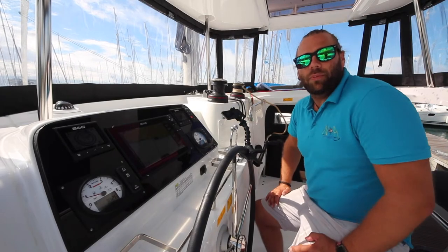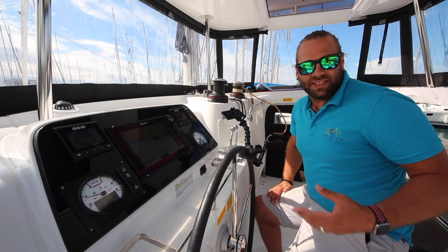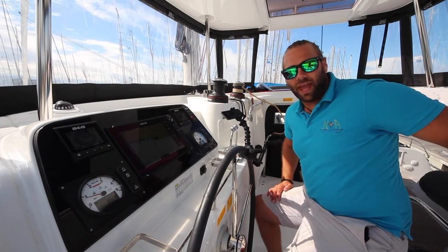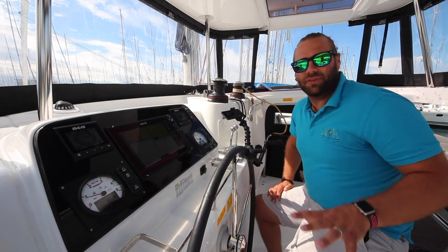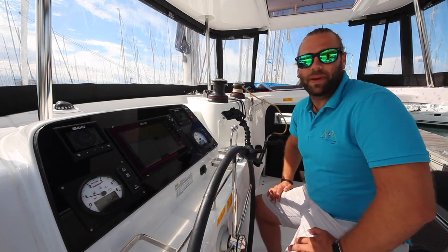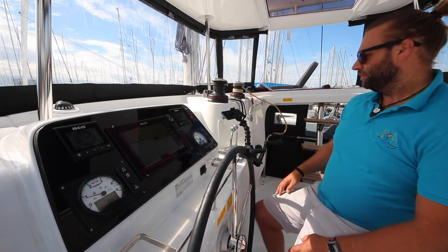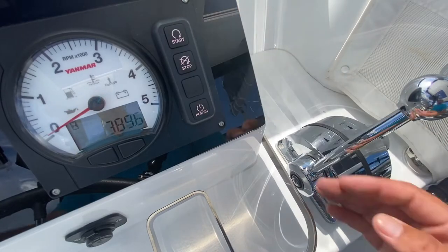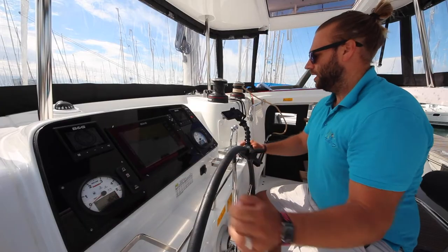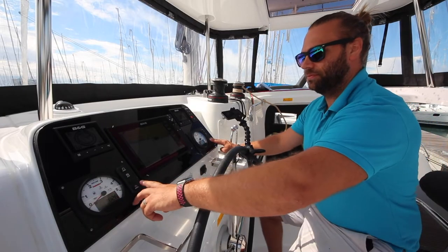Be very careful when operating the gears on board Kobukson, as the propellers are behind the rudder and very close to the stern of the boat. Make sure you check that you have no lines and nothing obstructing and no swimmers around the propellers before engaging gear. To turn the engines off, hold down stop, and then turn the power off to the panel.